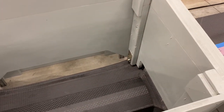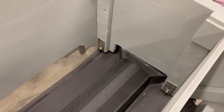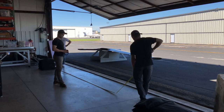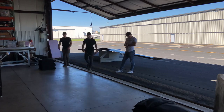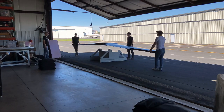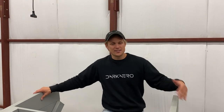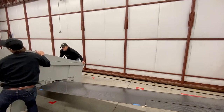There are four main structural bolts that attach the wing to the fuselage, and so right now the wing is basically hanging off the test fixture. The test fixture is made out of wood and it looks a little bit funny because we repurposed it from the positive G load test. There was a lot of effort that went into building the structure that allows us to attach the wing to this fixture, and we didn't want to have to duplicate that work, so we reused this test stand and added some legs to it that allow us to flip it over and support the wing in this configuration.